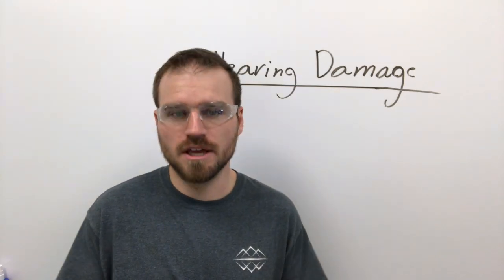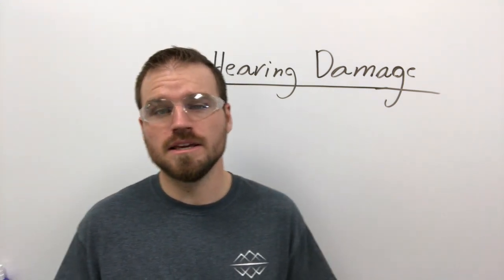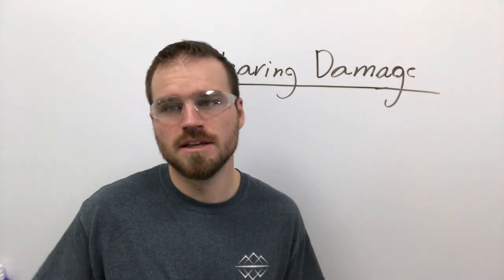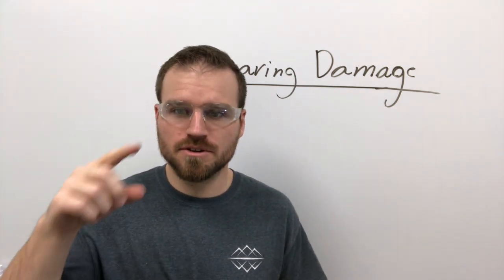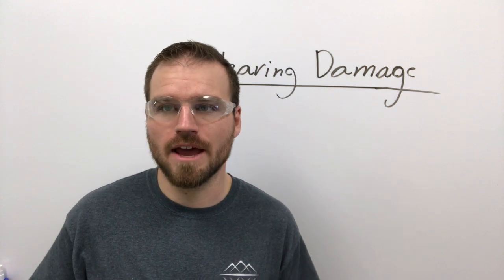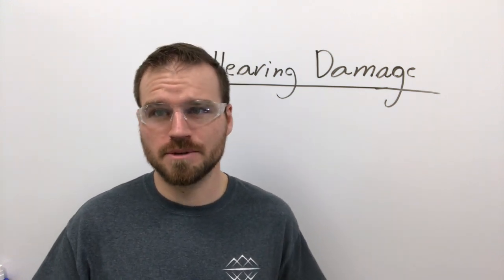All right, hearing damage. Now, there's two main ways to cause hearing damage in a weld shop. One, grinding. Grinding runs about 120 to 130 decibels, depending on the metal that you're grinding on. If you're going to be grinding, you need to make sure that you have hearing protection in at all times. If you're around somebody grinding, you need to make sure you're wearing hearing protection.